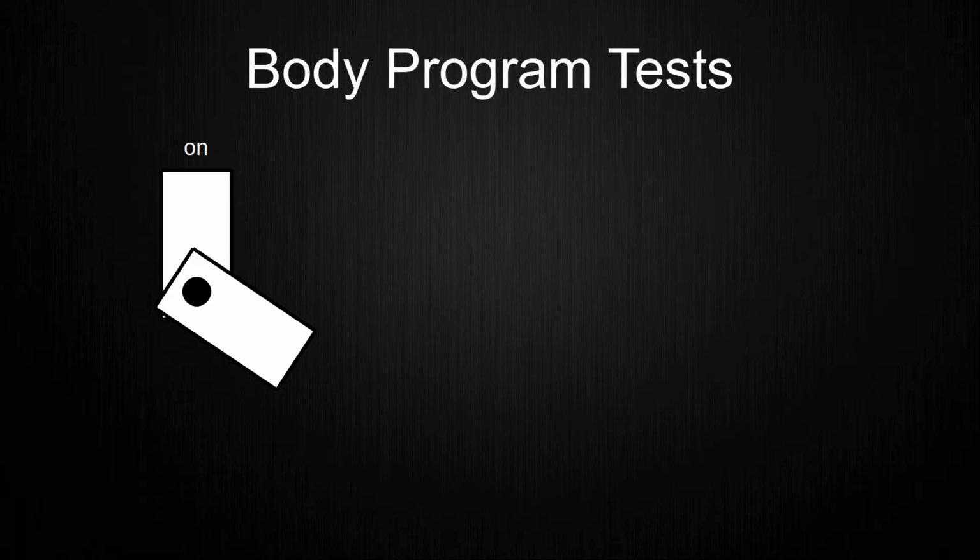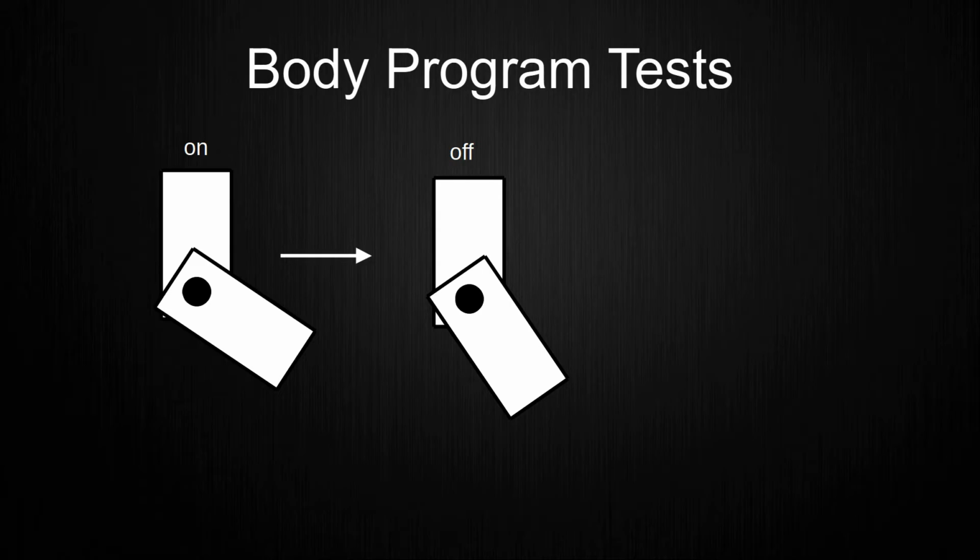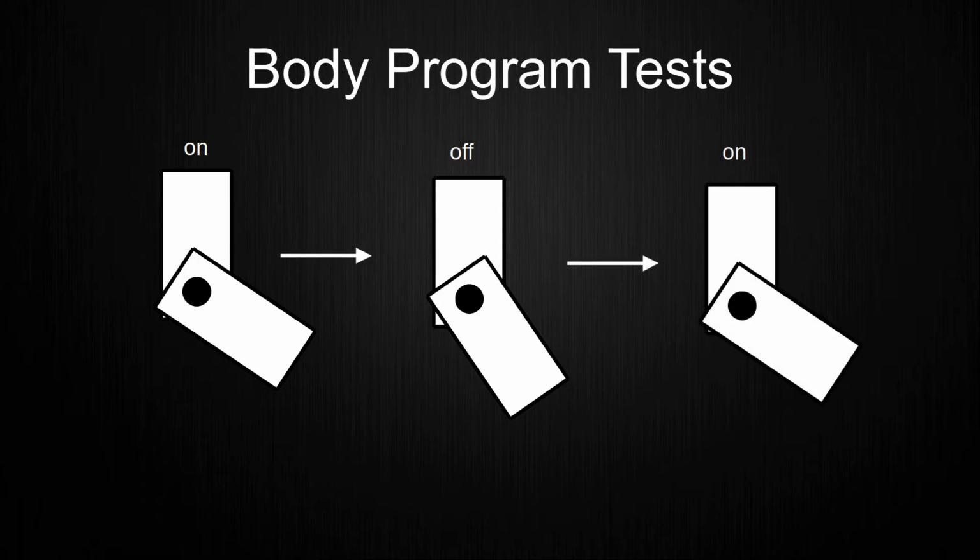Having this permanently in the background all day long was not an option for me, so I looked into available functions of the PWM board library and found a command to turn the PWM on or off. This results in the servos losing their original position, but they also stop making noise. The servos will go back to their supposed positions when turning the PWM output back on.